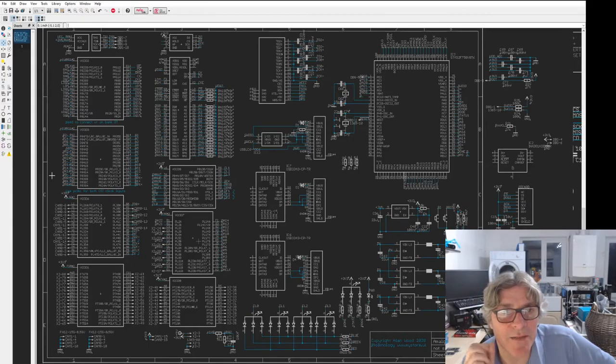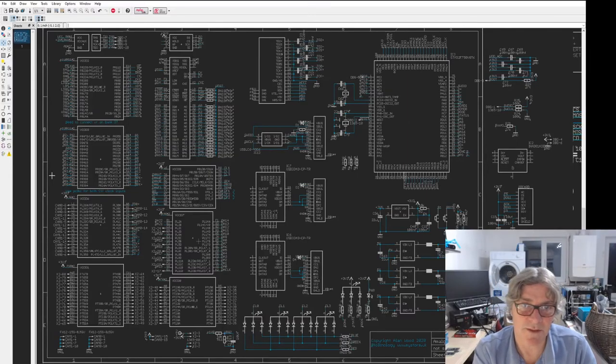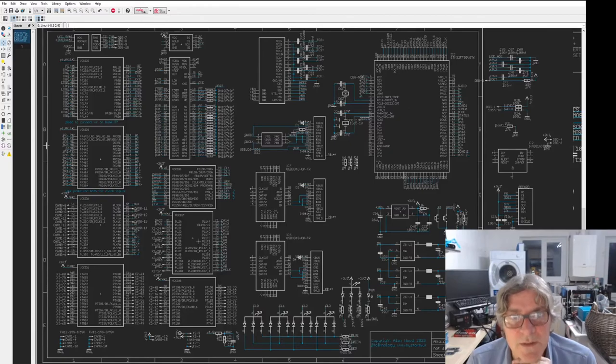The other things that are on the 80-pin connector I should mention. Obviously we've got the 64 digital IOs from the ECP5, which can either be single or differential signals, either 32 or 64, depending which way you're aiming. There's 8 analog ADC inputs. There should also be external UART pins, which may be useful for connecting to things like Bluetooth, so I want to add a Bluetooth option. There's a signal on there that's I2C. It can also do CAN. I'm not that bothered about the CAN stuff, frankly. What else will be on there? Are there any other signals on there?